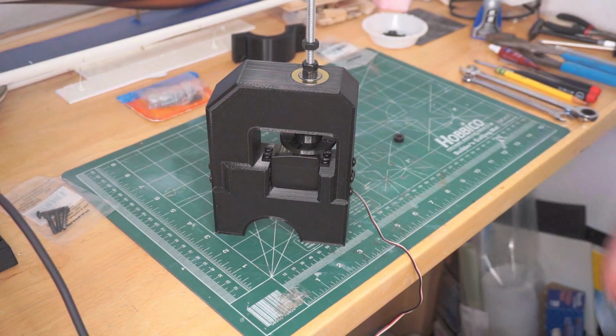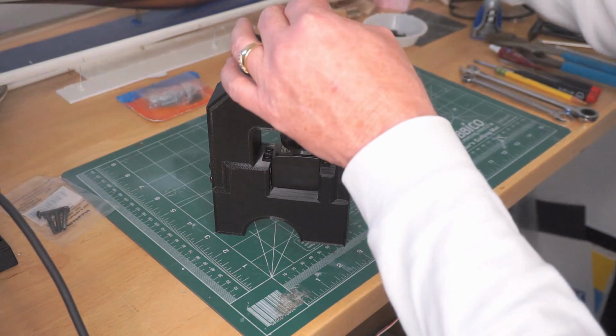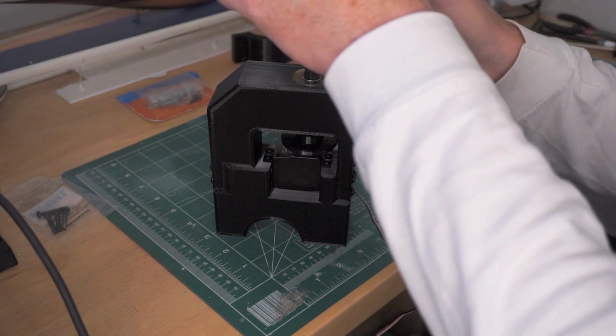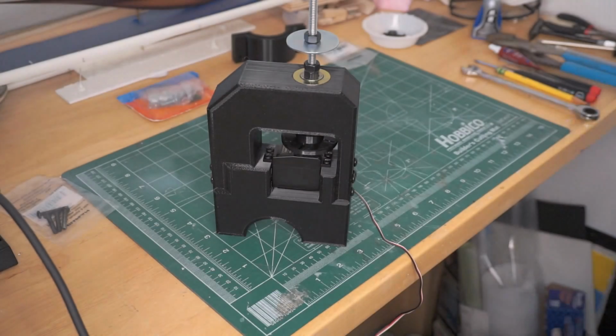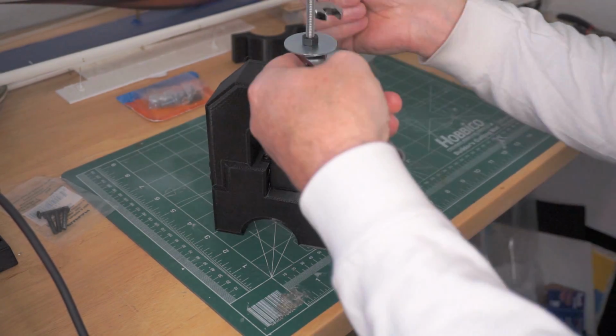With the assembly done, I added a couple of nuts on the output side of the shaft, and a large fender washer that I clamped between two nuts. This washer is what I would later attach the head cage to. This arrangement allows me to raise or lower the head cage as needed. I cut the excess thread off after I had the height right.